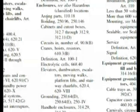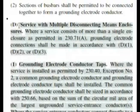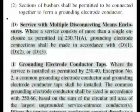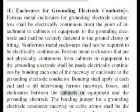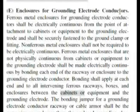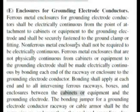Here we are at enclosures, and if we go down, we have grounding right here — 250.64D and 250.64E. We know those are going to be close to each other, and then 250 Roman numeral IV. Let's go to 250.64D first — this is not really what we're looking for at all. Let's go to 250.64E: enclosures for the grounding electrode conductors. Ours was for the grounded electrode conductor, and reading through it, this is one of those times where we don't get to the right place from what the index said.